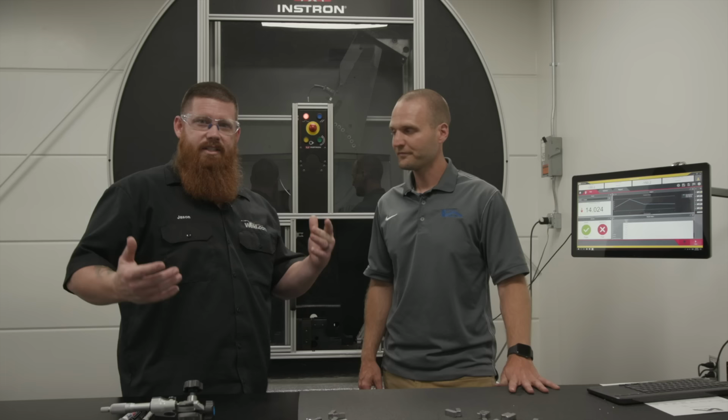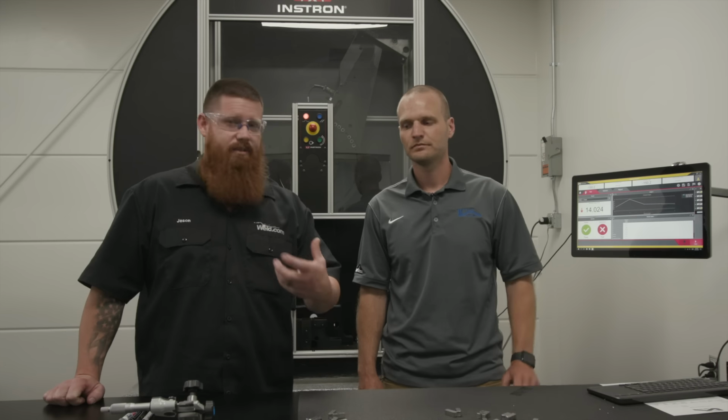Okay. Well guys, so there you have it. Stringers beat weaves in both of the tests, both the tensile pull as well as the Charpy V-notch. So we want to appreciate you guys watching. I hope you learned something, hope you can take something away from this. It's probably not the end-all, be-all to stringers versus weaves, but it's a pretty good start.